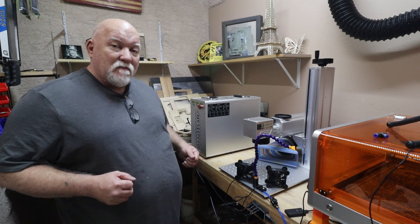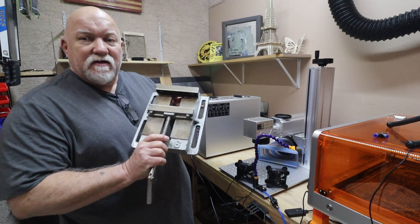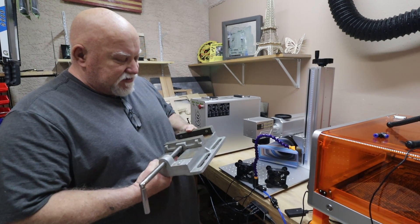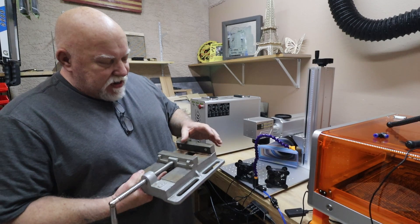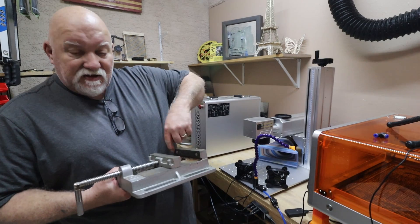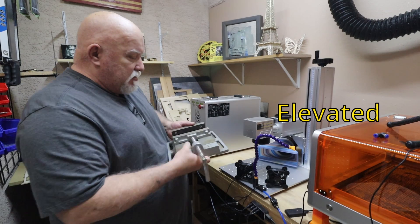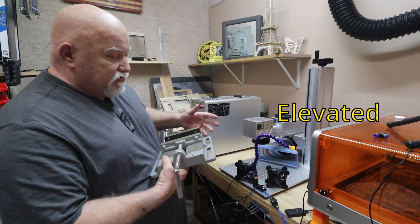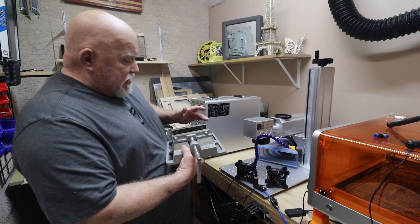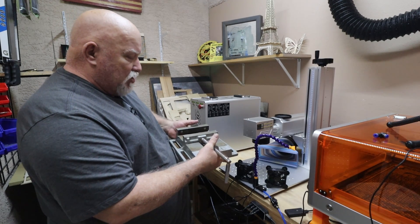My friend Jeremy at HTL Customs had a really awesome idea I've seen him doing. A lot of people go out and spend a great deal of money on a big vice like this — it's made for a drill press, came from Harbor Freight. It can technically hold work; it's got a slot there. But if you're going to cut outside of that area you'd need a slot in the sides to hold your material, keep it raised up. You can set metal, steel, stainless, copper, whatever you want to cut on there, use a couple of magnets on top to hold the work down and space it up off the build plate.